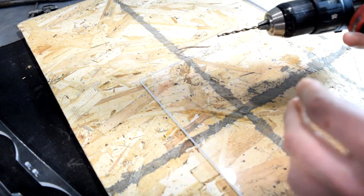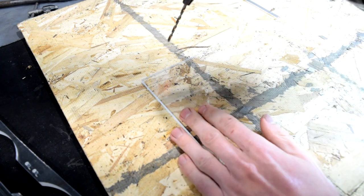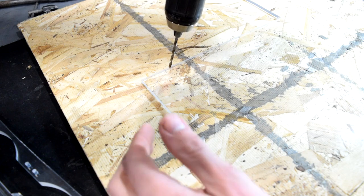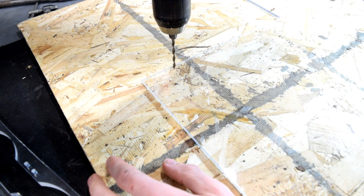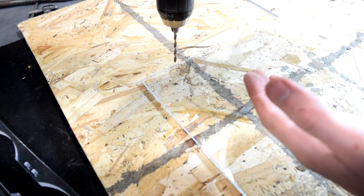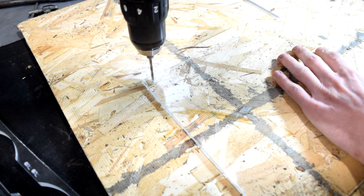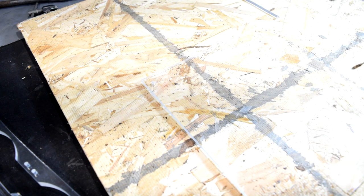Now that you've selected your appropriately sized drill bit for your tap, it comes to drilling. When you drill your hole for tapping, the key is to keep your drill bit perfectly perpendicular with the surface. You don't want it to wobble either way, unless of course you want a hole that doesn't go straight. Most prefer holes to go straight through, and it'll provide a much easier time tapping — your tap will follow the hole you cut, so it is really the most important step. There we go, one 9/64th hole ready to tap.